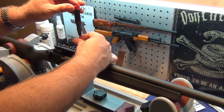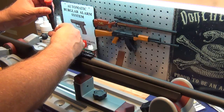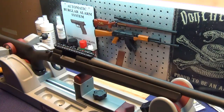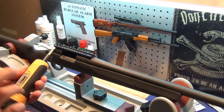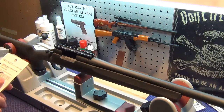What I like to do first, go ahead and just put those screws on until they just start to snug up a little bit. And then you're definitely going to want to have a torque set, and I use this fat wrench here, and we've got it dialed up. Now according to the documentation that came with the rail itself, it says to torque them to 20 inch-pounds.